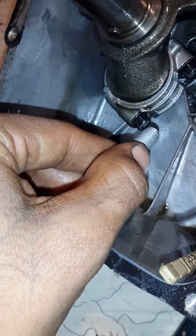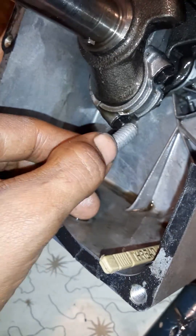In the oiling system, I'm not going to use this anymore. So I'm just going to weld a little thing onto this bolt, because I can't weld to the aluminum — I'd just melt it and make a big hole or ruin it. So I'm going to have to weld something to the screw. That's the adjustment I've got to do to that part.